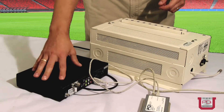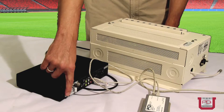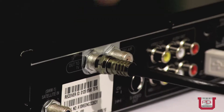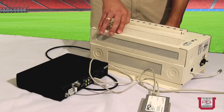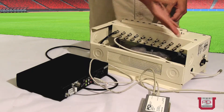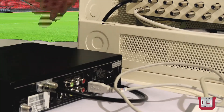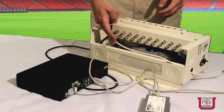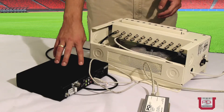The receiver box would then have the satellite signal coming in from the multi-switch. It would then have a single coaxial cable coming from its RF output, which is going to be set to either channel 3 or 4 with this switch. Coming into the 772 HE IND — this is the individual version — you'll see there are 10 individual inputs and 10 individual outputs. I've routed into the first input from the receiver, and this white cable shows the cable that would ultimately go all the way back to the television, which the Cat 5 cable controls.